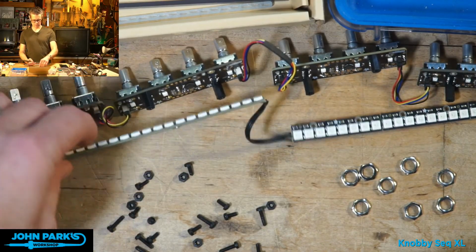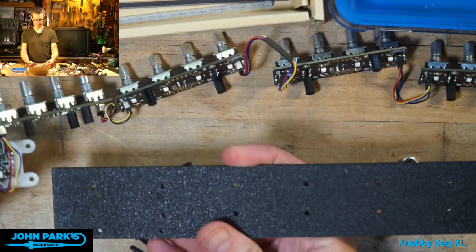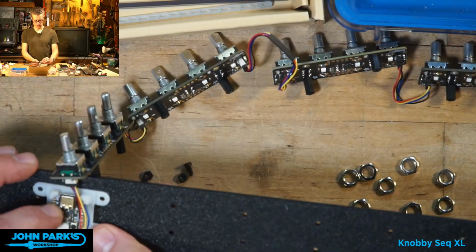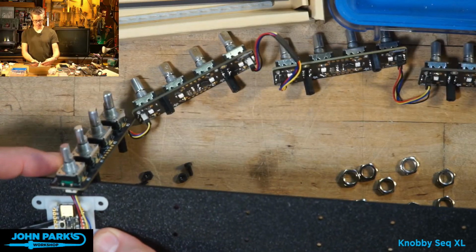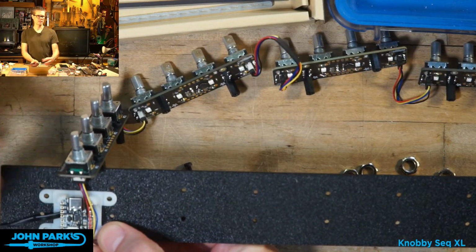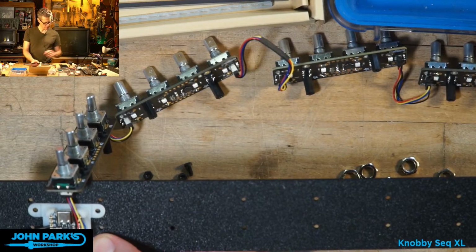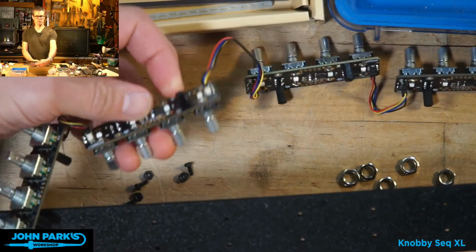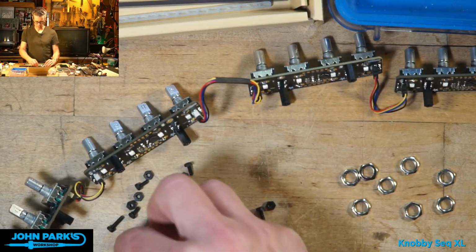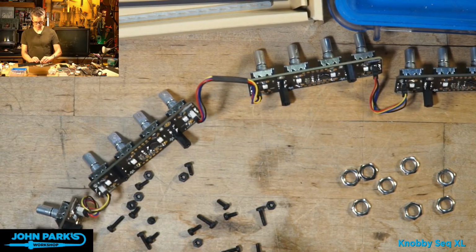And so the way this is designed, I've got the little QT Py. You can see some holes through there. I've got the little QT Py holder that will go like this onto there, I believe, yeah. And then on the upper holes set there, we're going to plug in these standoffs, these little M2.5 standoffs. So let's start with, I'm just going to use 2 screws on most of this so it goes a little faster, but we'll start with these.